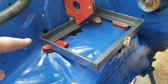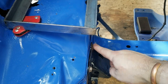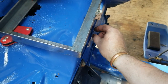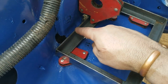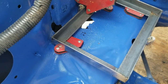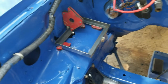I got it sitting where I think it's going to be close on these corners. I'm going to have to put a strap down to here. I think I've got it lined up where I can just surface weld the strap down to that. This one I'll do the same — it may just need a washer behind that bracket. Back here it's going to be a little tougher. I might surface weld on the other side and curve a strap up to these holes. Let me get a tape measure and figure out how long I need to make my frame mount straps.